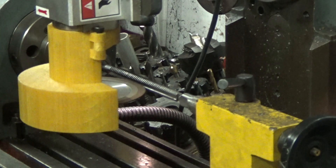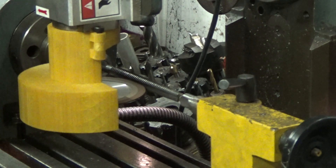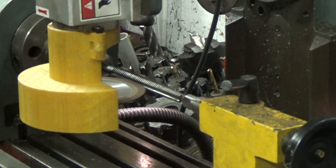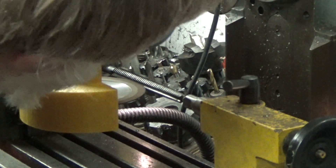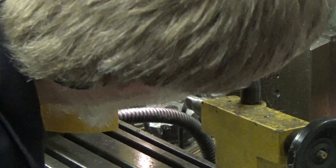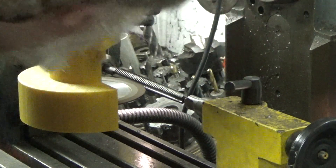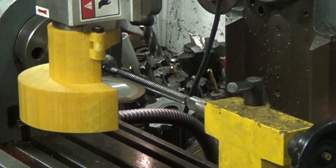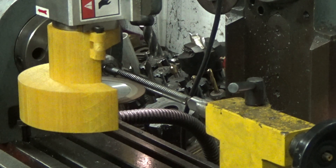I sharpened the flutes using a diamond wheel mounted in my milling machine high-speed head, using the same setup as I've previously shown for sharpening hobs. The difference being here that I've added a safety guard — a 3D-laminated one — which is probably of purely psychological value, but nevertheless makes the thing a little less scary to be around.